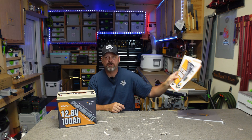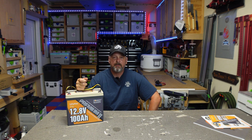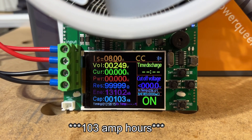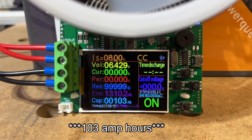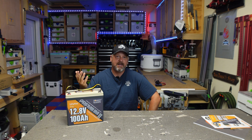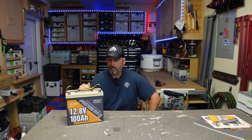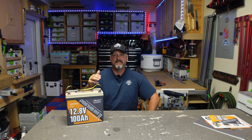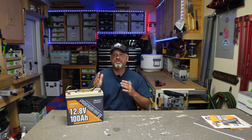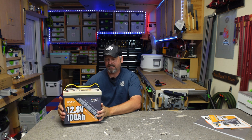Back to basics: 100 amp hour battery, 1280 watt hours. I did a DC discharge test and was able to pull around 104 amp hours out of it — more than the rated 100 amp hours — which theoretically reduces the effective price per watt hour. It has a continuous max discharge of 100 amps, and a 250 amp surge max for about five seconds, which for a battery of this size is quite incredible.